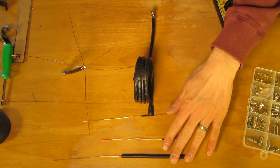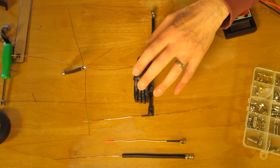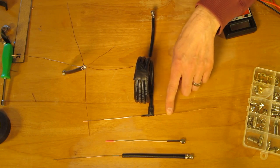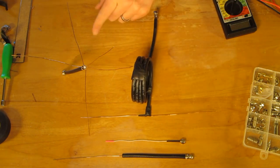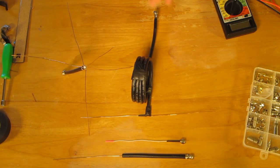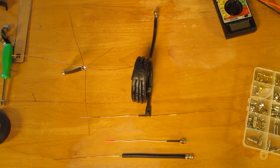Here are four antennas — actually two versions of the same one. This is the quick stub antenna using the F connector, this is a dipole with a choke balun using coax and an F connector, and last but not least a quarter wave ground plane using a piece of coax and an F connector. All four can be made relatively quickly in a few minutes. You don't need any solder — just electrical tape, an F connector, and some coax. All four will get at least a marginal signal out.